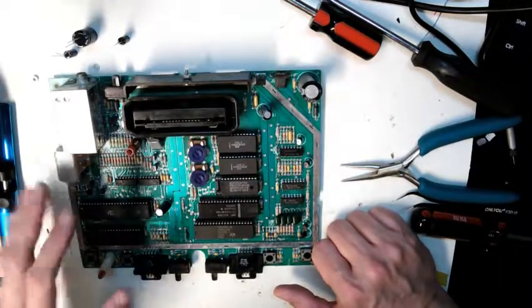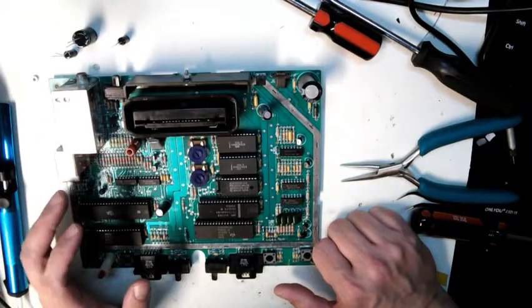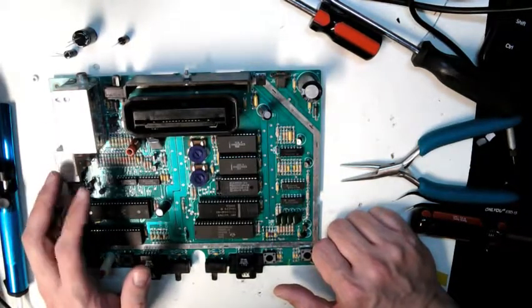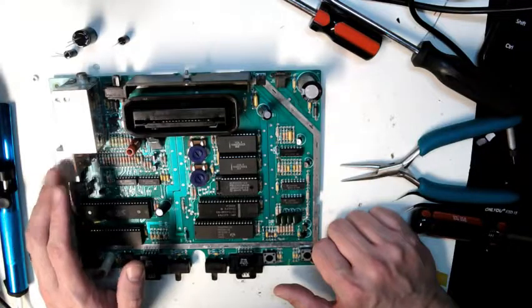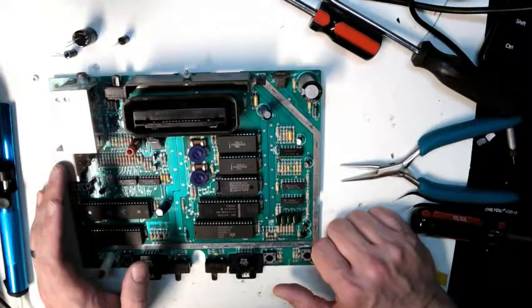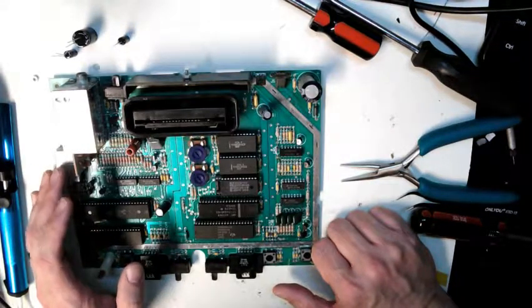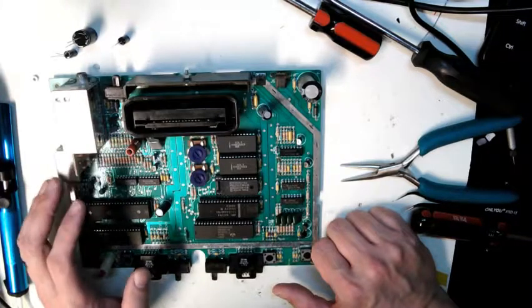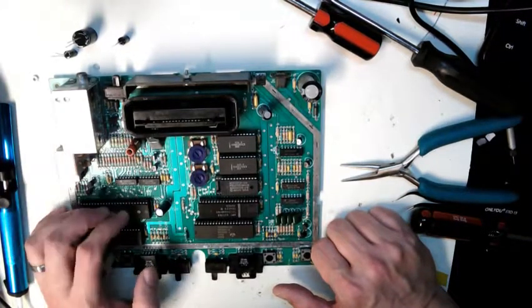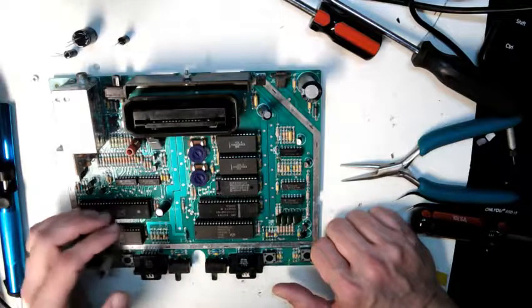So the way these old systems work, it was just like the 5200. Actually, this system has two chromas because it has a 2600 chroma and a 7800 chroma. And chroma is just the color channel of the system, and then they have 4 lumas, which is the brightness. So those all need to get summed up together and then fed through just a transistor to amplify it, and then impedance matched to go out into the outside world.